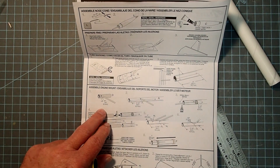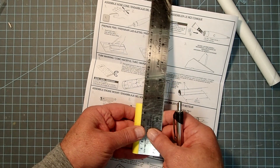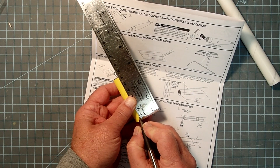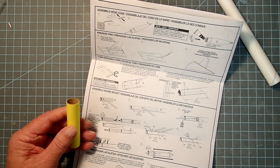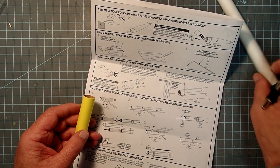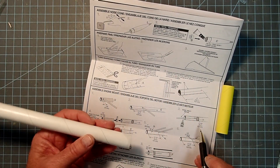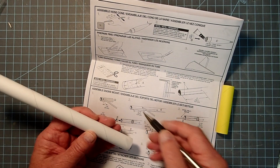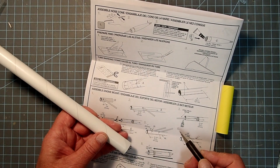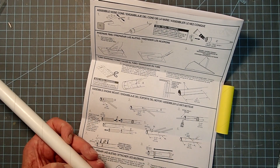We need a mark on the engine spacer at a quarter inch (6 millimeters) from the aft end. The two-and-a-half-inch mark on the body tube you don't really need to do — instead, we'll measure two and a half inches on the applicator that we'll use to do the motor mount. I'm going to go ahead and do these first three steps: marking the aft end so I don't get it confused, then measuring two and a half inches (6.4 centimeters) on the applicator using a ruler.